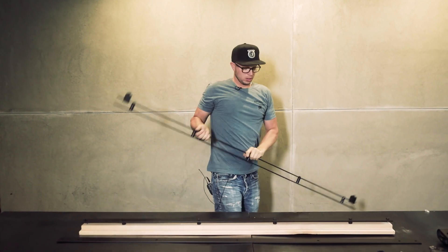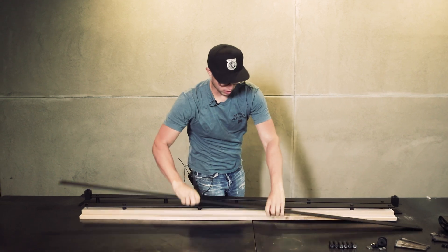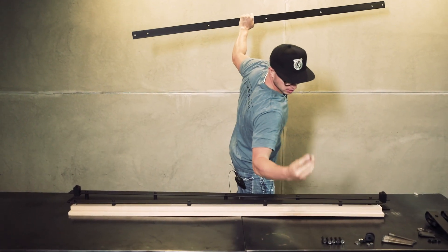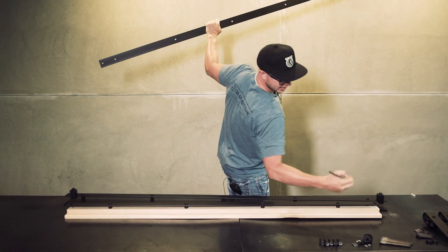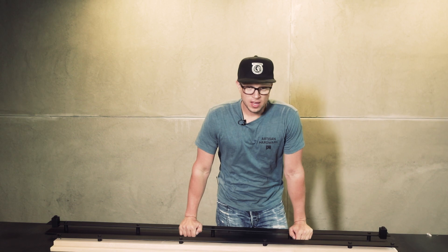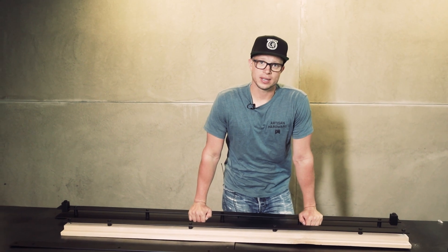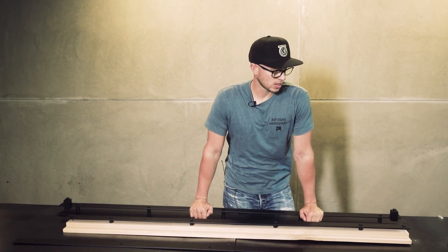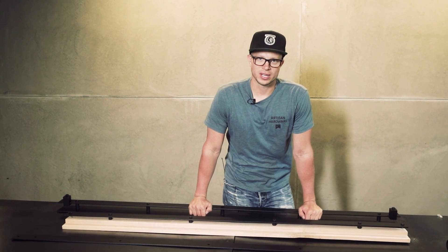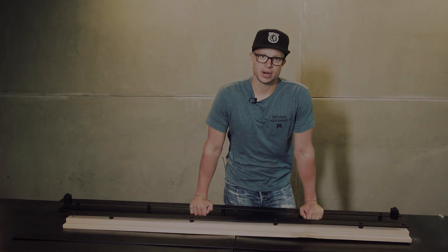Whereas a normal, traditional set of sliding barn door hardware, you'll put up and have to add the spacers and the lags and the stops — a lot more time consuming. If you can, I would go pre-hung. It's quite a bit more efficient and I think you'll like installing it a lot more and get in and out quicker and have a better install.